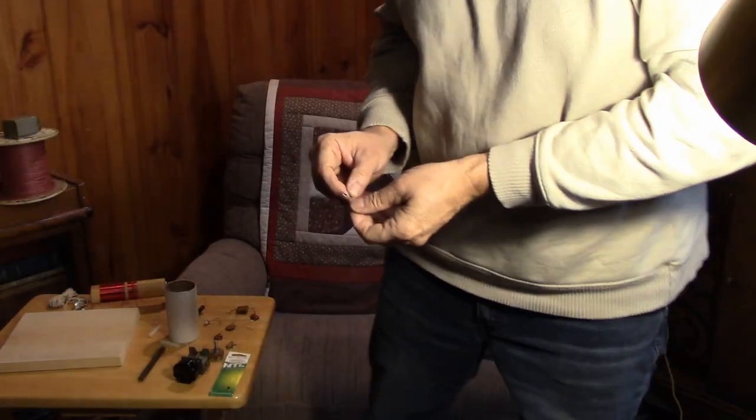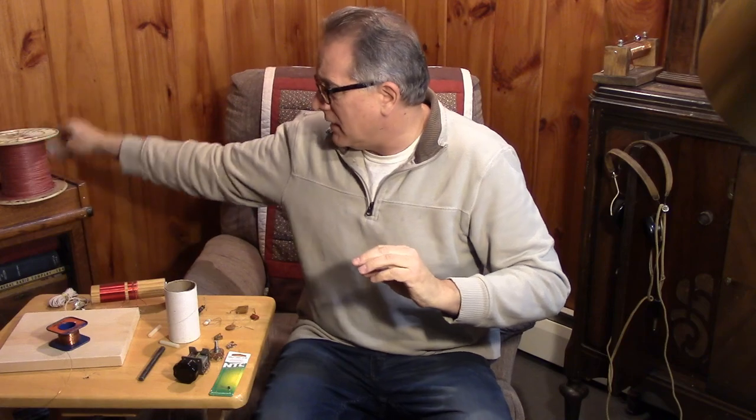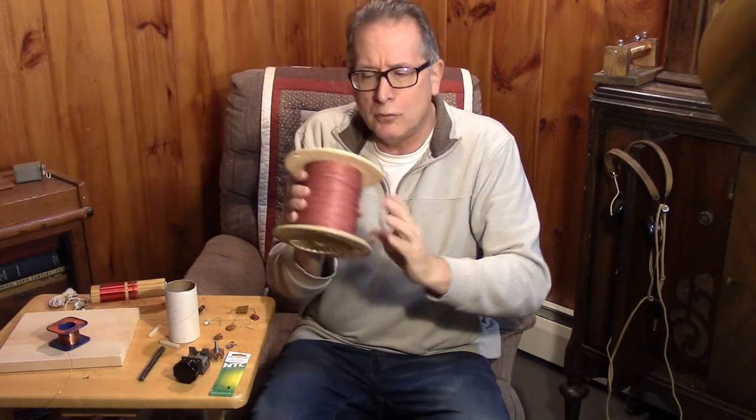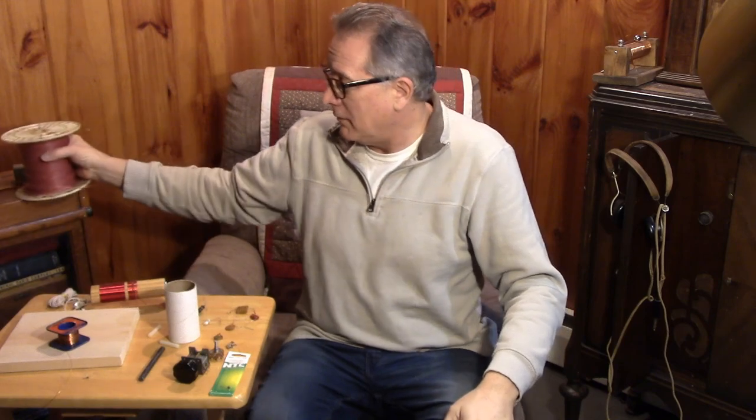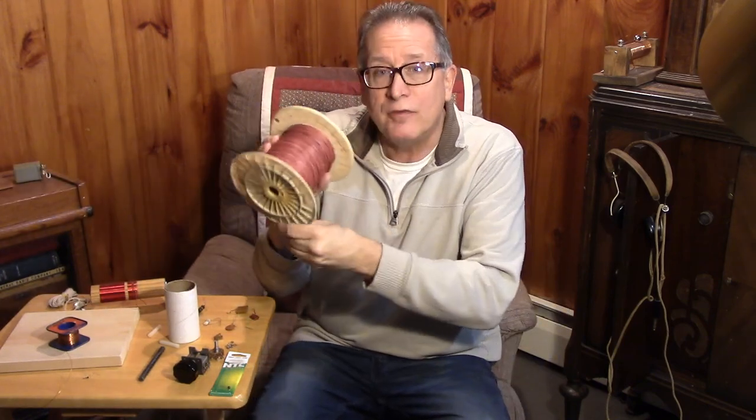What can we talk about in terms of wire? 'Mike, I can't get the number 26 wire you're specifying. I only have number 28, or I only have number 24.' The crystal radio doesn't really care what wire you're going to use. Even if you've got telephone hookup wire from the 1940s, you could probably make your crystal radio coil out of it. If you've got some small wire with a good insulator on it, go for it. Build your crystal radio out of that — maybe we could even use this for the antenna.